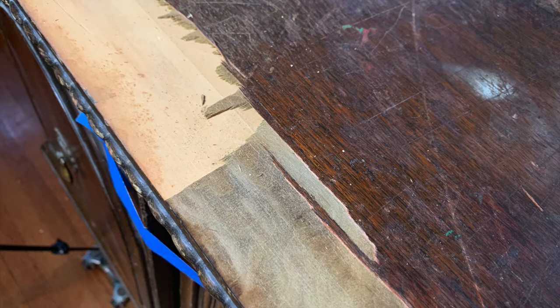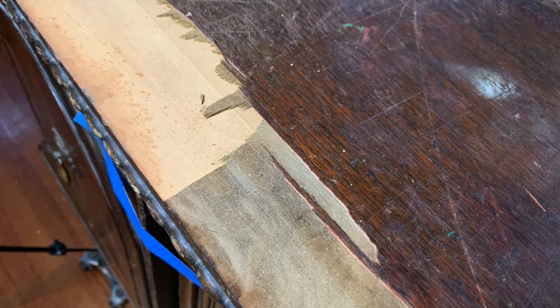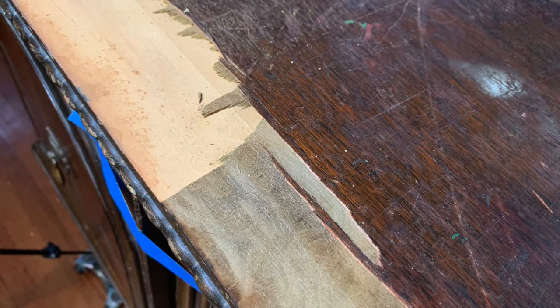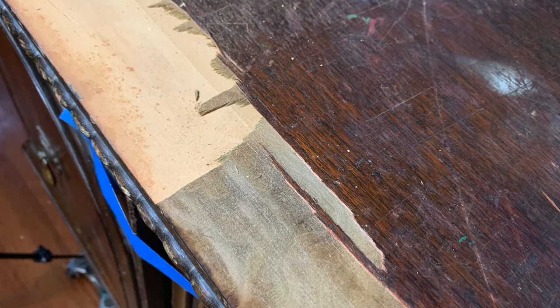When you're removing veneer, I want to show you what you'll find underneath. There's the top layer of the pretty veneer that they put down, which is normally stained to color. Underneath it is a not-so-good wood that they put down so it is a smooth surface to apply the glue for the veneer. And underneath that is usually the crappy wood — the absolute base wood. If you can only remove the top layer of veneer, that's best. But sometimes, like with this piece, the other layer underneath will come up. Don't worry — there are ways to patch it, but keep in mind the very bottom layer might have holes, knots, and some damage that you will have to patch.